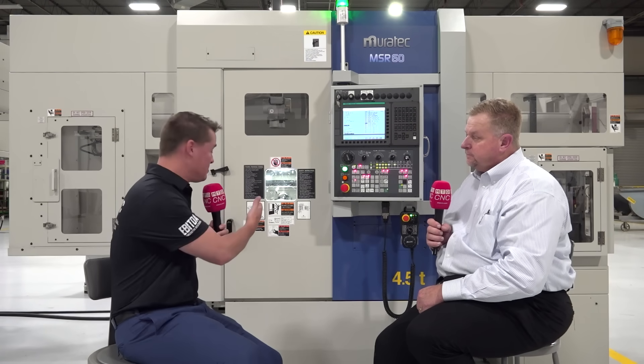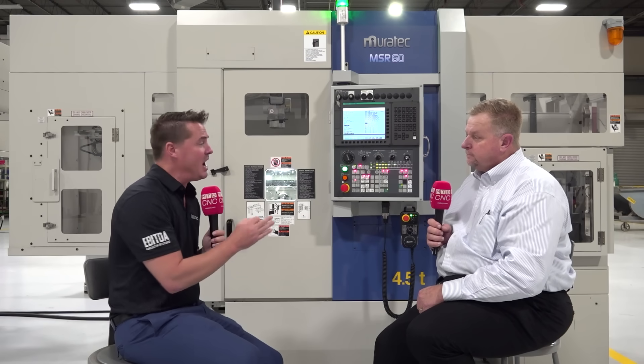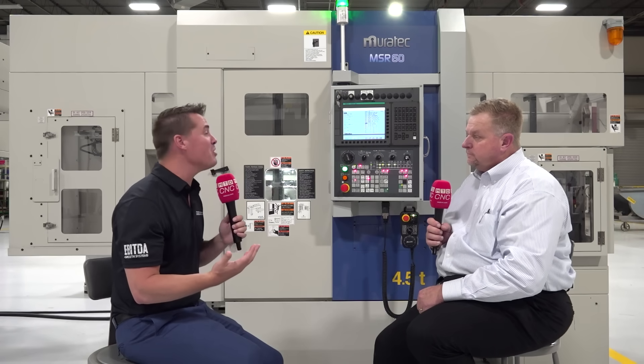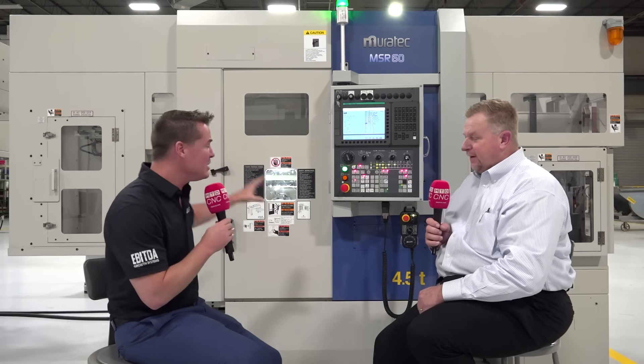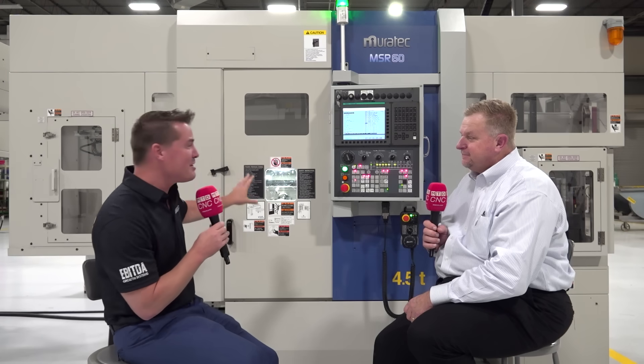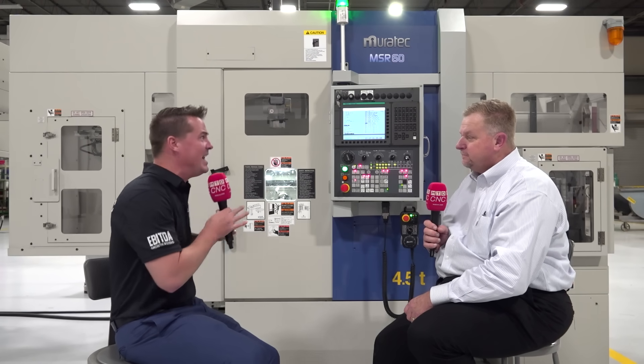I want to talk about something fascinating, because we do work in a world of Op 10, Op 20, Op 30, Op 40. In our twin spindle and multitasking machines, if Op 10 and Op 20 are both 30 seconds apiece, we have a perfect world — and that's almost never the case. We might have one that's a minute and a half and one that's 10 seconds. So let's talk about how — and I like to call it a Lego system — where you can actually remove this back end, add it to another cell, and make all of those operations work together.